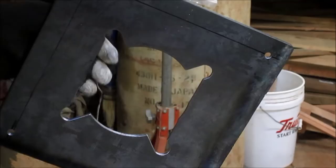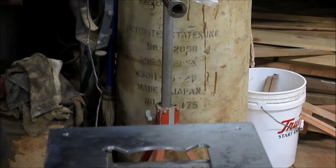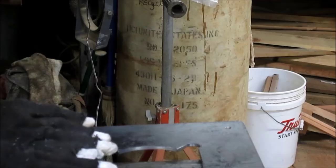So now we want to come up with a couple of blocks of steel of some sort or another with a little distance between them. No distance between them. They're going to be sandwiched together, and we'll weld them to the plate, and then we're going to come in behind that and cut this plate of steel and separate the two. And then these two pieces of steel will be our index to make sure that everything's nice and tight.